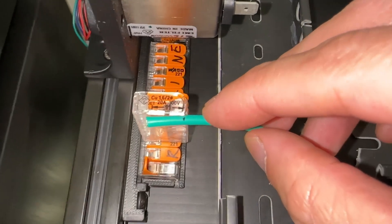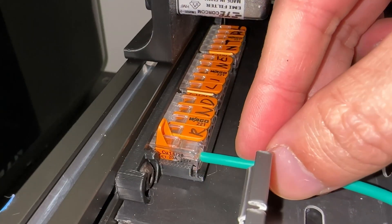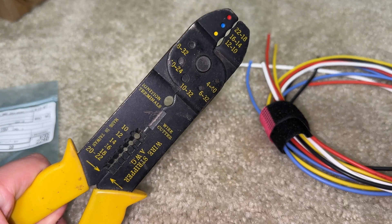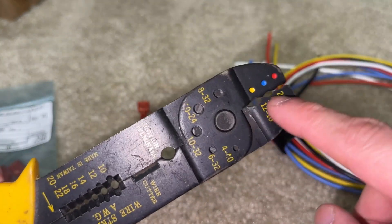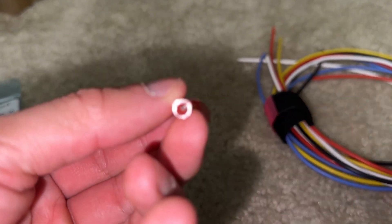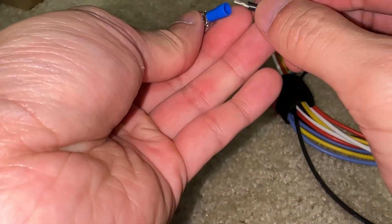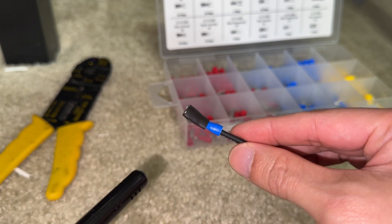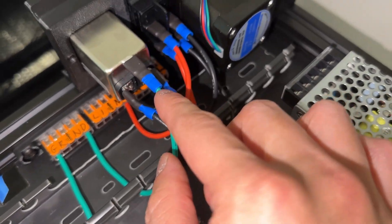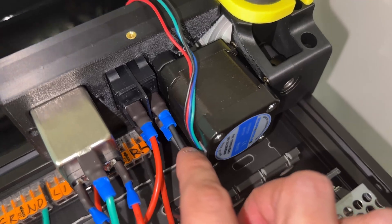AC wiring. I start with the bed ground since I need the excess wire for other connections. After measuring and stripping, make sure you insert the wire all the way in — the insulation should slide past the entrance hole. I am using common wire strippers with a built-in crimper, but there are dedicated crimpers with a ratcheting feature. The thickest wire for red connectors is 18 gauge. The spec requires 18 gauge minimum for AC wiring, so these connectors were sized accordingly. I went with 16 gauge, which requires larger blue connectors that are insulated manually using heat shrink. I am following the WAGO wiring diagram from the manual, which is straightforward. Be careful not to reverse the line and neutral wire connections. I am using red for line, black for neutral, and green for ground.